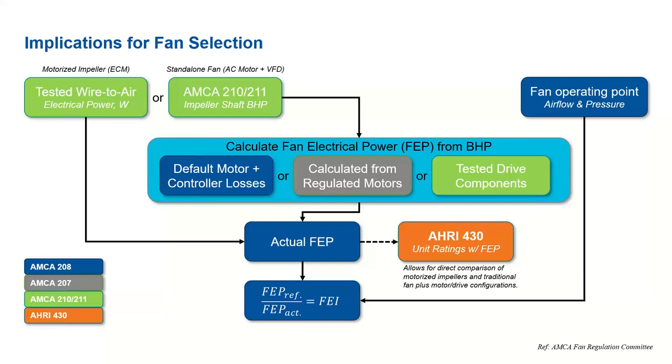So as we said, in the belt driven fan system, we have additional components, the belt and the pulleys and sheaves. So it depends upon the application. Most of the time it will be comparable to the ECM and direct drive fan system, or it will be a little lower because of these two components, as losses will be there. So if you see the graph I showed initially, it will be around 5 to 10% lower depending upon where it's operating.